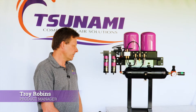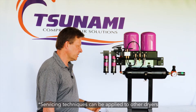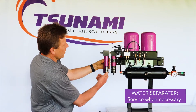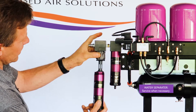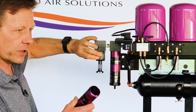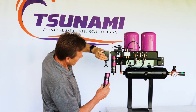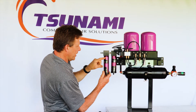Servicing the Pure 5T is a very simple task. You want to discharge all the energy in the drying system. One thing you can do is check the water separator — it's a stainless steel mesh, so servicing or replacing this element is rarely needed. Pull the mesh out, hold on to it as you take the tube out, and look inside the tube for big chunks of debris that could foul up the float drain or the pneumatic drains.